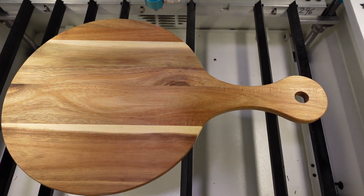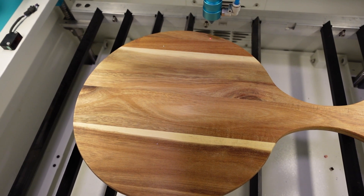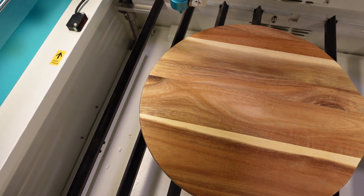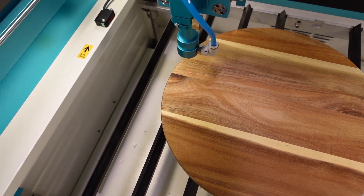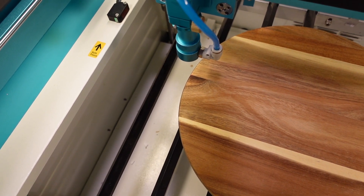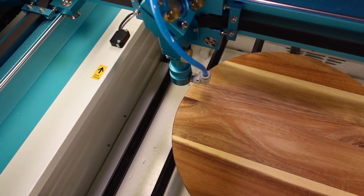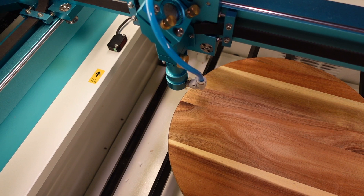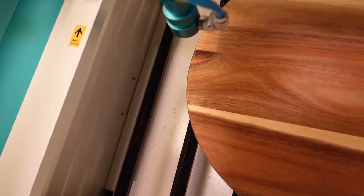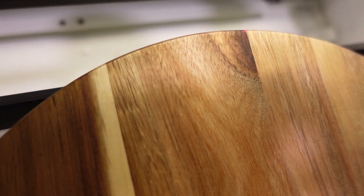You need to do this step in Lightburn for each point. Click that, and now it'll tell us to set our second point. So we will head back over to the laser and drive the laser head over to make the bottom point of our triangle on the bottom of this cutting board. We are aiming to get a triangle in three points to get this circle. You'll see me struggle a little bit here to get this exactly where I want — I drive it back and forth a few times before I get it exactly on that edge. So maybe that 21 millimeters per second would have helped me out here. You'll find that if you aren't doing a lot of this precise movement, you may want it around 100 to 200 millimeters per second, but when you want to be really precise, you definitely want to be under 100 millimeters per second. That looks pretty good right there, so we're ready to set that as our second point.